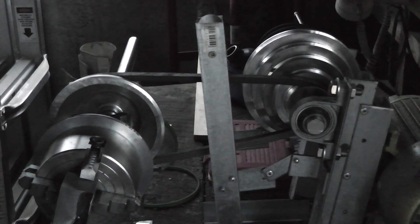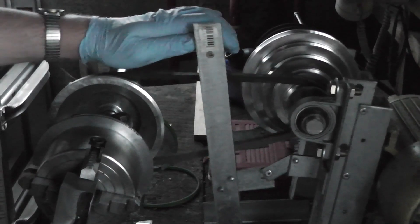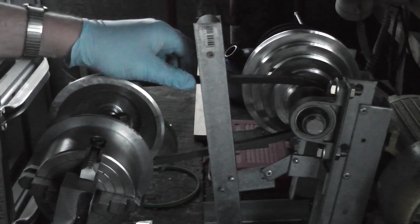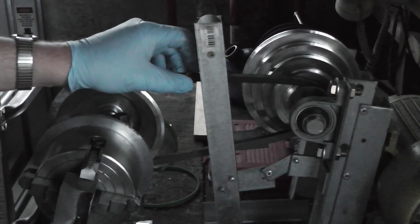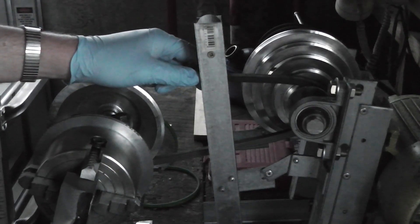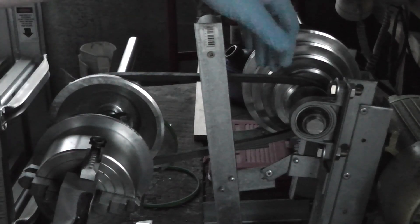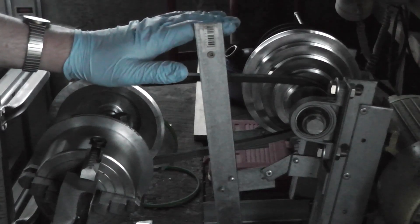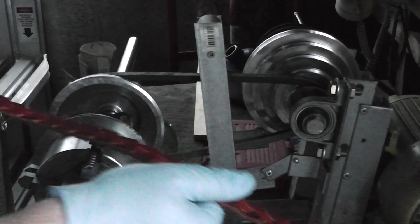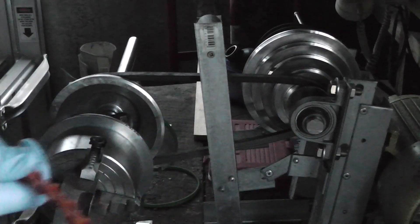Hello, welcome to Have a Go, I'm Alan. As you just saw, this tends to go wobble wobble wobble when the lathe is going. I'm pretty sure this is mostly due to the belt I'm using, which is a rubber V-belt. The rubber doesn't like having to continuously move around and change its shape like this — it bounces because it's elastic. So I'm hoping if I replace it with this nice shiny link belt, this might even improve matters.